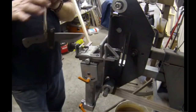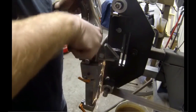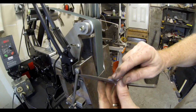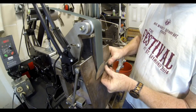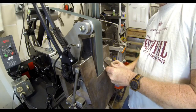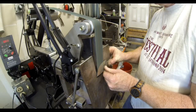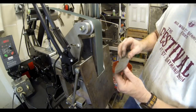What's neat about Jason Northgard's tilt table jig, or tilt table grinding, is that you can use both of these jigs. If I'm going to do a quantity run, I can do all of the rough grinding and the heavy material removal on the Master Smith Pro Bevel Down jig, and then I can move over to the tilt table and clean up the plunge lines, or make the plunge lines even, and then also polish the bevels with a finer grit, as long as the tilt table and the Master Smith Pro are both set up at the same angle. And that's accomplished with that digital angle meter. You're zeroing them out on the platen of both, and then also on the actual jigs.